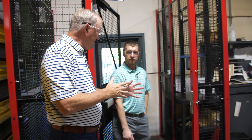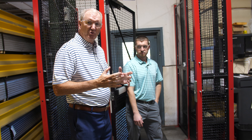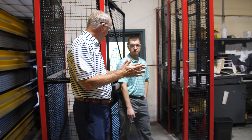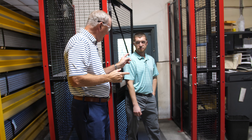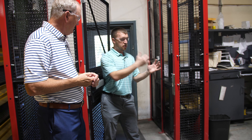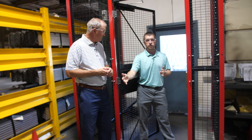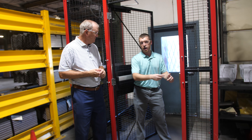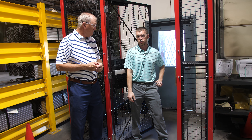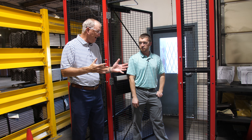What's really good about this versus the old electric strike is we had to know if the door was going to hinge on the left or the right, and whether it was swinging in or out — but not this one. If you get it out here and you decide you don't like this door on this side, you can flip it around and do the other one. Or if you want to change the door so it swings the other way, you just rotate it. The post doesn't have to be made special to accept different hand doors. That's very handy because you can change the swing of the door in the field.